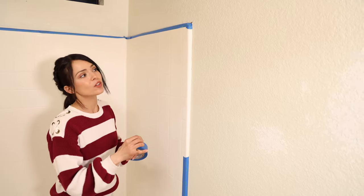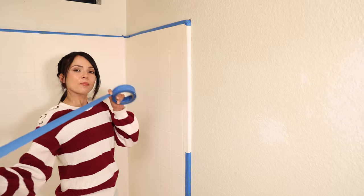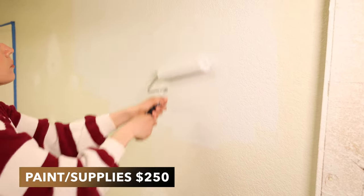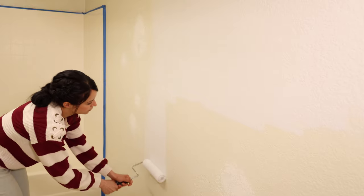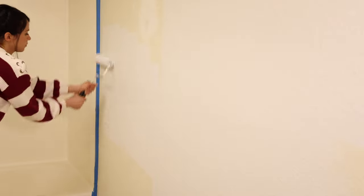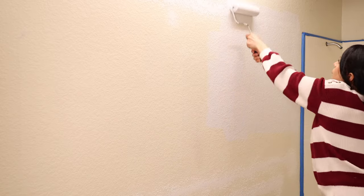The texture on the wall is almost dry. I've been taping - luckily we don't have a lot to tape, just the bathtub and the wood framing around the light. I didn't use a primer because this paint comes with paint and primer in one. The color is called Sterling White - it's an extremely light gray that looks almost white when first rolled on the wall, but it's not; next to a true white you can really see the difference. I'm going to paint the door and baseboards white to make this color pop. We went with the satin finish because the coverage is very good for bathrooms - it has a slight sheen but it's not super glossy looking.